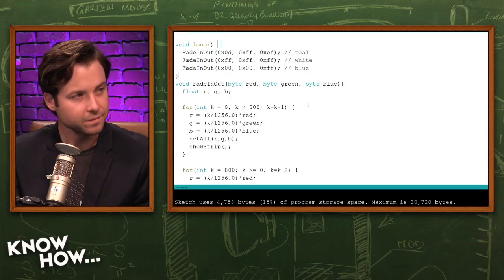And people should remember, the reason why we're using a library is because otherwise we would have to program all of that. We would. Right. Let's remember the way the WS2812 lights work. You create an array. You fill that array with the values. The values would be the light. What kind of color do you want? What kind of intensity do you want? Right. And then you push that array down the string. And every light will take 3 bytes for red, blue, green, and then it will pass off whatever's left to the ones down the line.